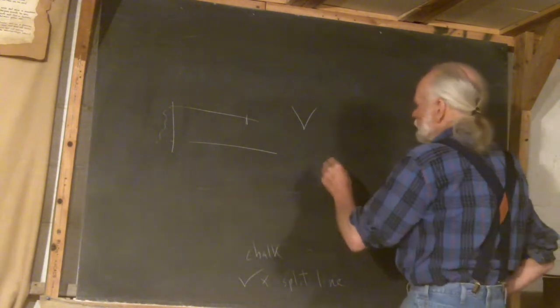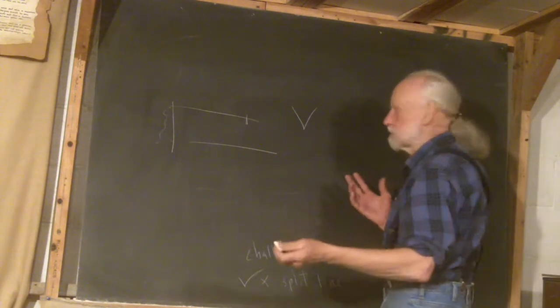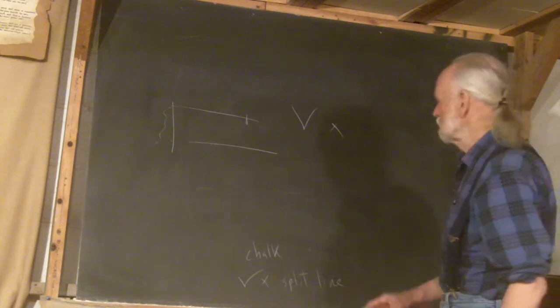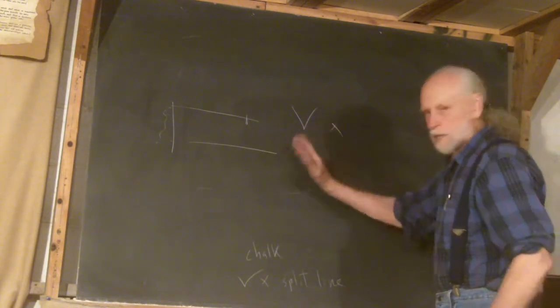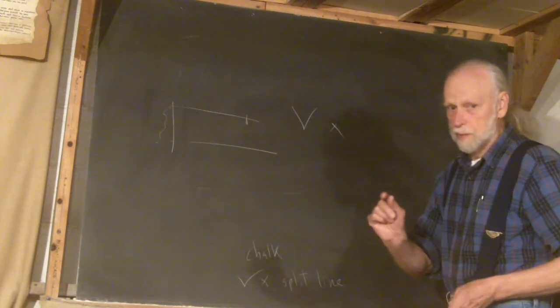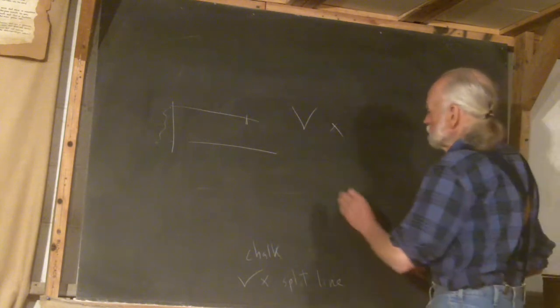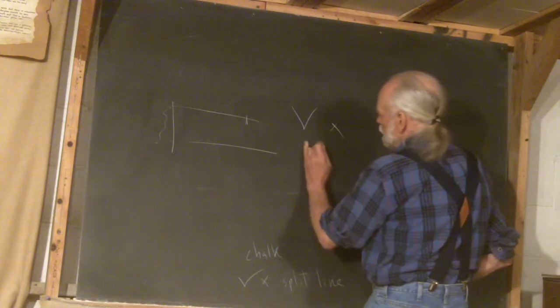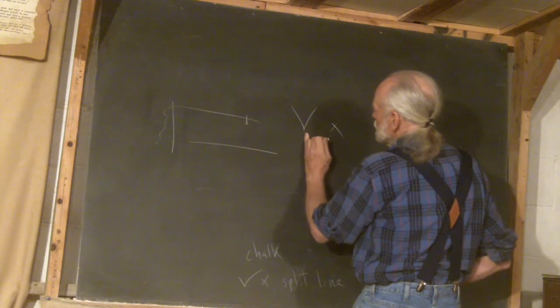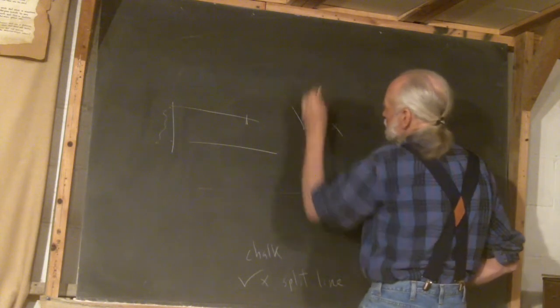And then when you go to saw, you also have to decide which side is scrap. You put an X for the scrap. Now they do that. I see them do that. That means which side your saw is going to run on, because the saw is going to take out probably an eighth of an inch or so. And so it's going to run on this side. And what you try to do then is you just split that. Split that right in half, right there.